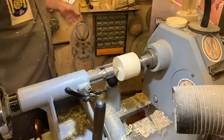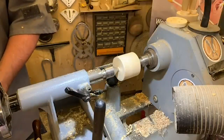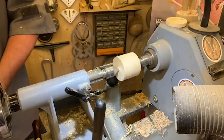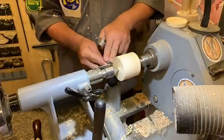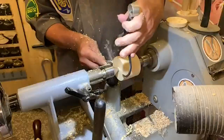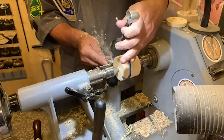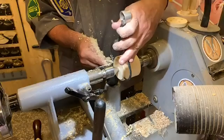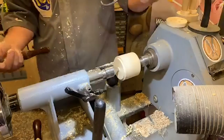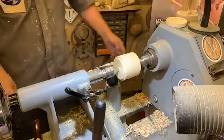Could you pre-drill the holes before turning and parting? On this piece, yes, I don't see why not. I'm not putting the calipers all the way over at the moment — just giving myself a bit of a guide, so I can see when the wall of timber comes close to the caliper point, and then it pops over. Nice and gentle, no need to be too heavy-handed with that type of cut. That's all ready for the chuck.